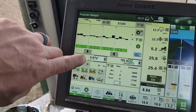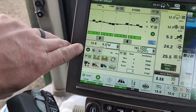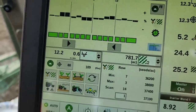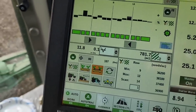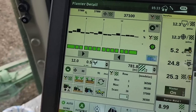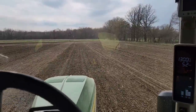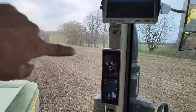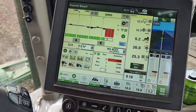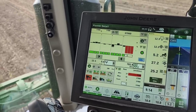We've got a bit of an issue here. That right there is a vacuum reading and it's showing very, very low - it should be around 12. However we're still planting, and you cannot plant without vacuum, so it is either a sensor issue where the sensor itself is bad, or the vacuum tube heading to the sensor is disconnected or plugged. We'll have to check on it, but I'm not going to worry about it as long as we're still planting. Some rows are shutting off on us because of the curve out here. I just noticed the vacuum sensor said zero, but I'm planting so it can't be zero.